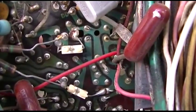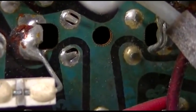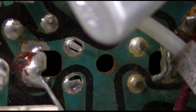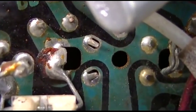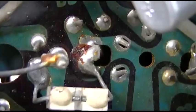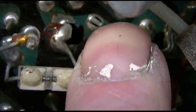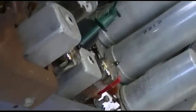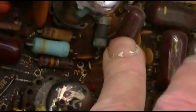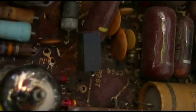Okay, we'll start off taking a look at the color issue, and I'm pretty sure I found it. We're gonna deal with the focus issue here again. See that one right there? Yeah, that one right there. So start off with that, and then I'm going to replace this double diode right here. Let's see if we could get rid of the twerky horizontal.